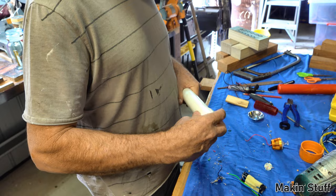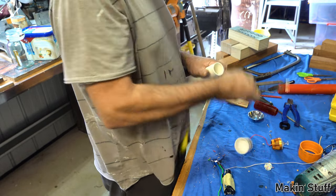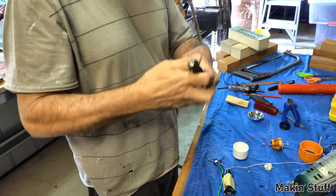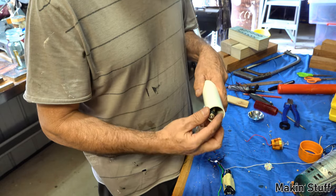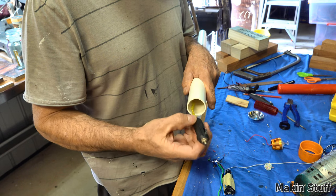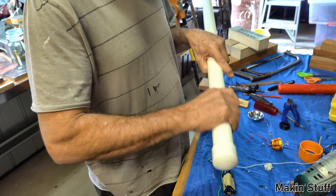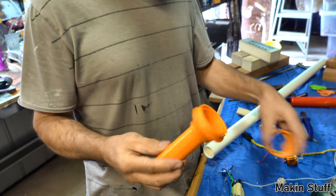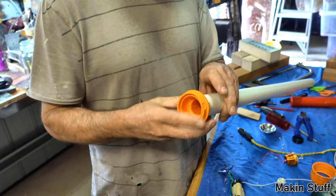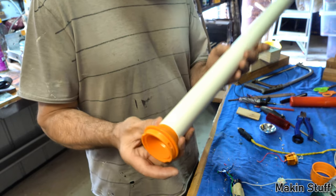and what I'm going to do is, instead of having this end on there, I'm going to have inside the PVC tube, coiled up inside it, I will put this plug so I can pop the cap off, pull the cigarette lighter plug out, plug it into my car, charge the torch up, put it back in, and we have a torch ready to go. I have to work out what length I need to make this overall shaft of this thing to fit the capacitors and the head of the torch and that in there. Basically, that's it. So this old torch, all the components for it, including the head, I'm going to cut this down and it should fit up into this PVC tubing nicely. I'll just glue that in there, so that'll be the head of the torch and it'll be all complete. And I'll just work out what length it is.